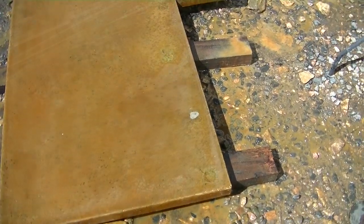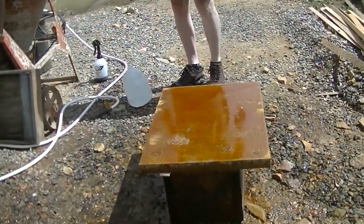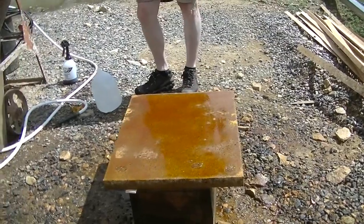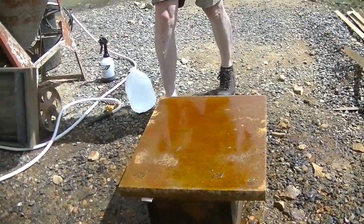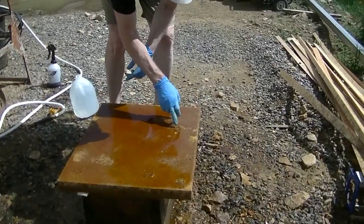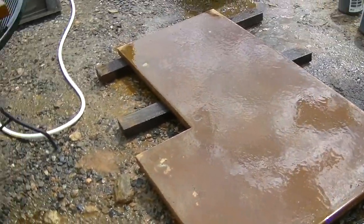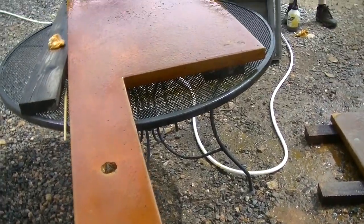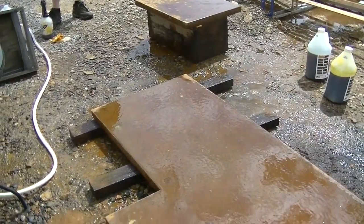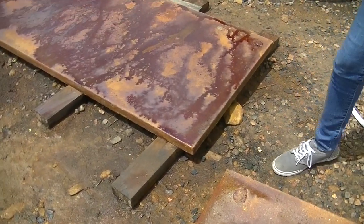So remember when we did this little piece, it was a different bag of concrete to finish it. What we decided to do was put on a second application of the acid stain, a blend of both the brown and the red, so we could get a darker color, deeper hues. It's hard to tell until you wipe it off to see how much the color's developed, and we've been surprised in the past that it can happen within minutes. But we decided to go more for the hour mark instead of just the 10-minute mark to see how that would help. So we are at a good solid hour with the stain on, and now you can really see that red color developing.